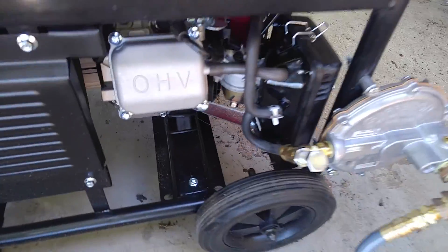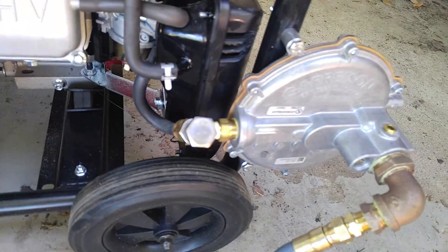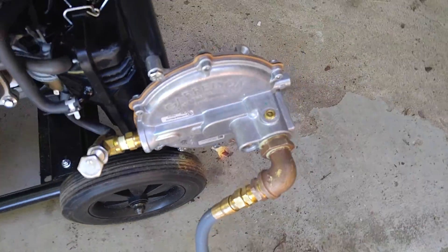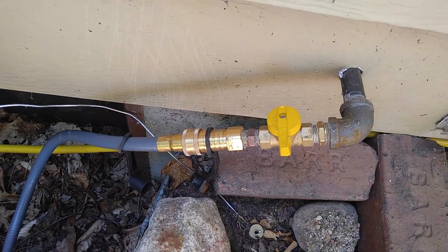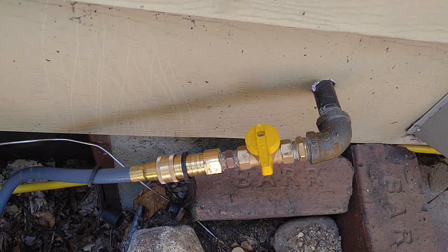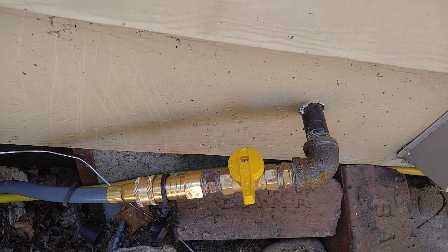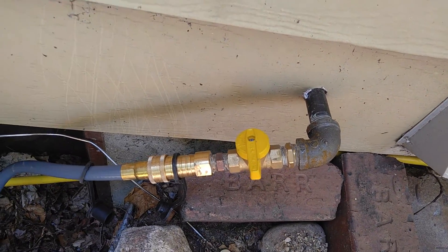Got the plate mounted between the airbox and the carburetor at the shortest possible distance to the regulator. Got the screw set all the way out. Got some flex line back to the house — half inch pipe back to one inch pipe to the gas meter. It's approximately 10 feet of half inch and 10 feet of inch, and there's a tee that splits to two one-inch lines: one that goes to the furnace and hot water heater, and one that comes to this tap.